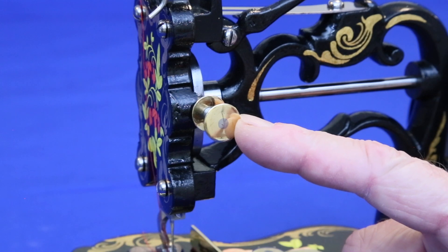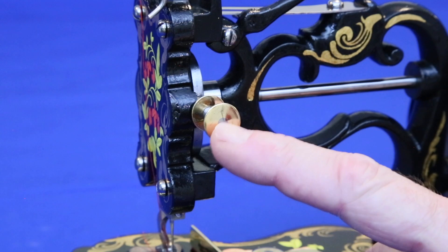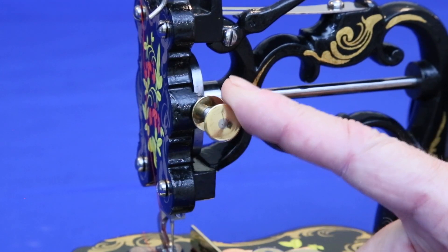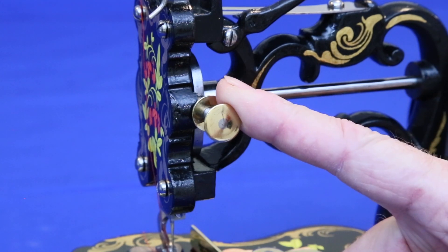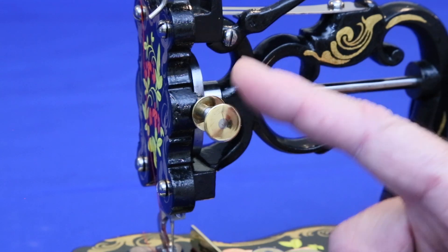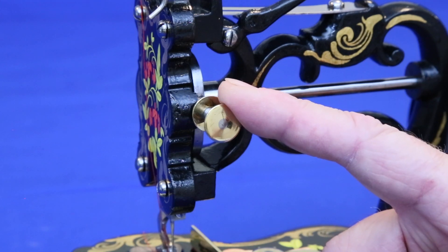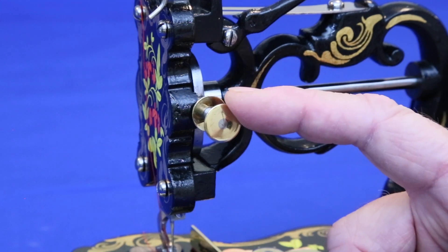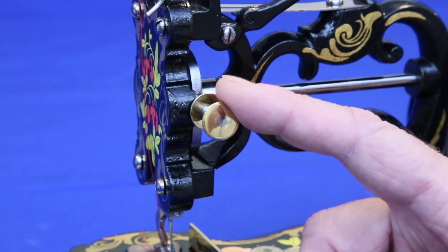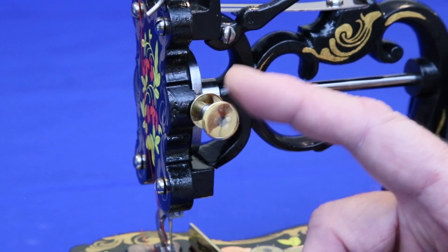Another interesting feature is this thumb screw, which consists of a brass cap mounted on the end of a threaded steel rod. Normally such brass thumb screws are machined completely out of brass. One possible explanation for this more complicated two-part construction is that there are many brass nuts used on this machine, identical to all of them and to the cap on this thumb screw. It's reasonable to assume that in the long run it was easier to make a large number of these nuts and modify them into thumb screws than making thumb screws from scratch.